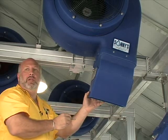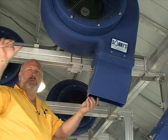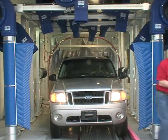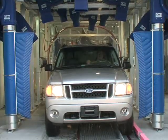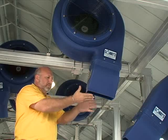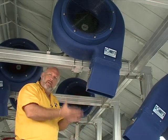At 100 cars an hour we might set it at 12 degrees. The nozzle above is actually facing the back of the car as it exits the tunnel — the top of the car should be dry as it leaves, and that last nozzle, flipped toward the back, does the rear glass. Even a nozzle coming straight down will tend to follow and contour the shape of the car.